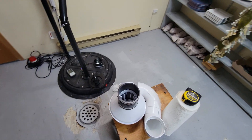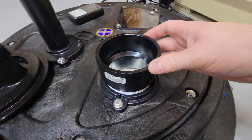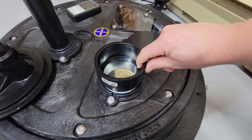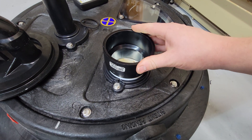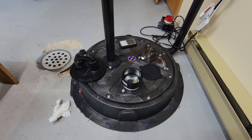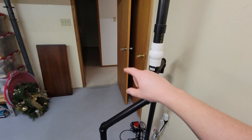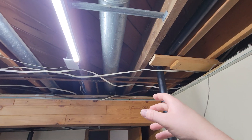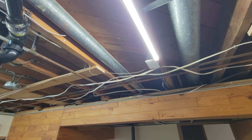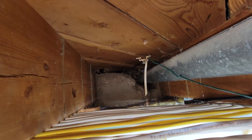We're beginning work on the radon mitigation system. The three inch pipe threads right into the fitting that comes with the lid. We have to go from ABS to PVC and then use PVC for all of the piping and fittings going up and out. We'll measure up to where we want to put the radon fan, then go at an angle up between the floor joists. We're going to have to rent a big drill to get through the foundation.